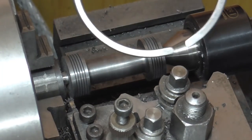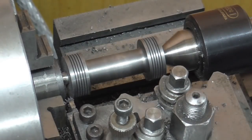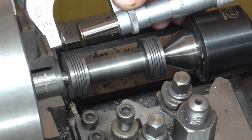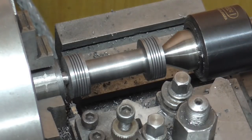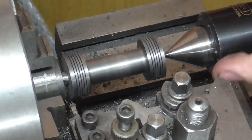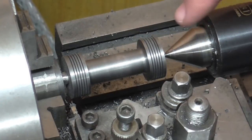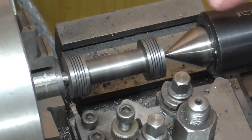Right, we're down to size — these by the way are calipers, in case anyone's not familiar with them. Now all I need to do is take this to width. Just about any micrometer is going to struggle to get in here because the center body's in the way, so I'm going to remove the tailstock. One very important thing when installing and reinstalling tailstocks during an operation: do not turn the center and do not turn the chuck. I will be cleaning the two before I re-engage them, but if you turn it then any run-out in any of these systems ends up revealing itself.